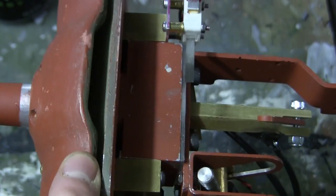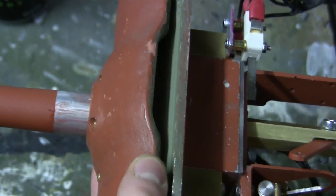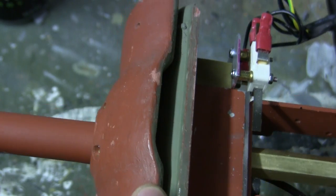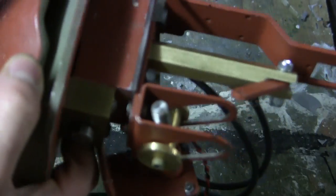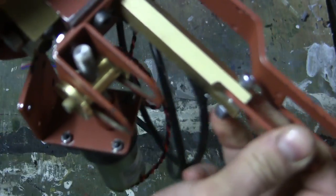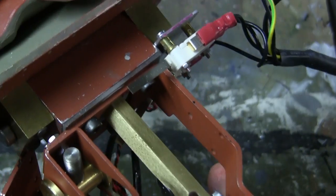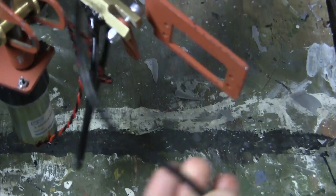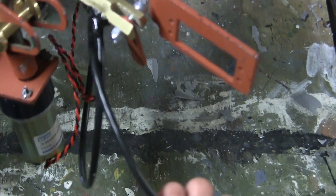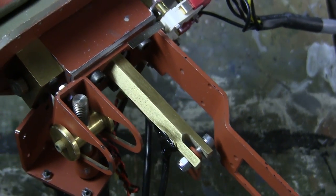And the barrel is now into its appropriate recess. As you can see, it moves very easily and glides along the lubrication and the bearing, which was supplied by the Armortek kit. With the barrel now in place, I can now install the servo, which will be used to connect the barrel via the swinging link and keep everything in place. Once this is done, I can patch in the electric portion to the recoil module from Armortek and hopefully hook everything up and calibrate it.